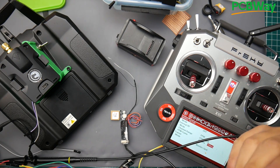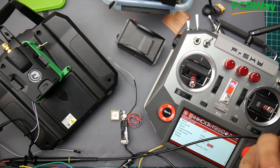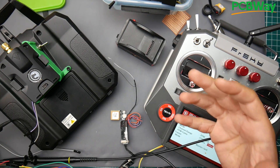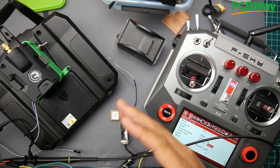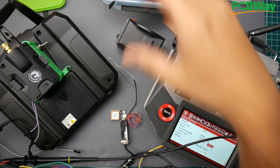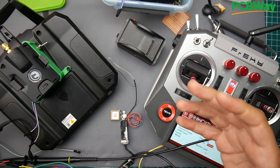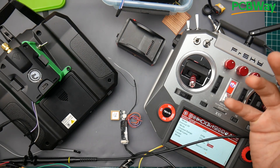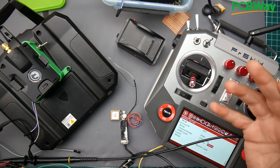You might again say what is the point of all this? Well, some people are disabled. Some people don't have two hands. Some people have a missing finger. There are people out there who have special joysticks, and this will allow them to play whatever they want with any kind of hobby grade RC car, because you can put any of these receivers in and control these through the multi-protocol module. This hack will not just work for the R9M and TBS Crossfire — it will work for anything that takes PPM input, allowing a person to fly that little cheap Chinese drone they always wanted to but couldn't because of a special condition.